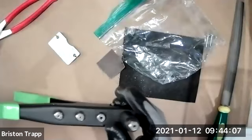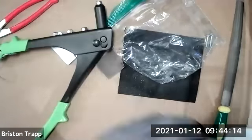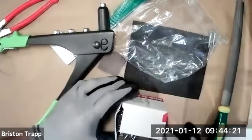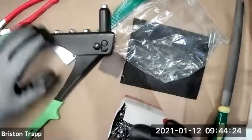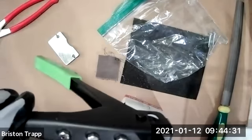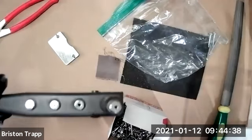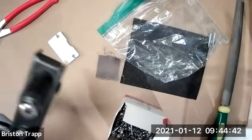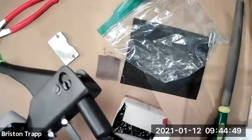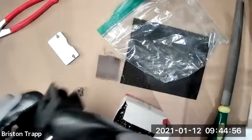You can go ahead and swap out the nose piece. You should have a box of 1/8-inch rivets. These rivets are much smaller, and these are the rivets that we're going to use for our projects. So go ahead and swap out the nose piece back to the 1/8-inch diameter one. It should be the second smallest one, the one that was most likely already installed from the manufacturer. So take out the large one. Swap it with the one that fits the rivets in the box.